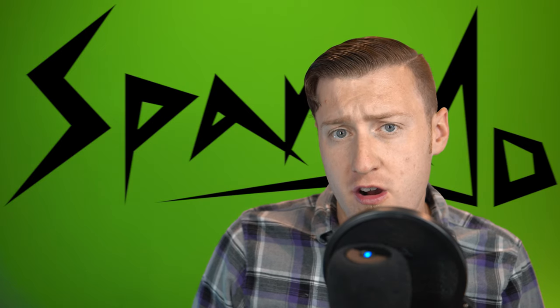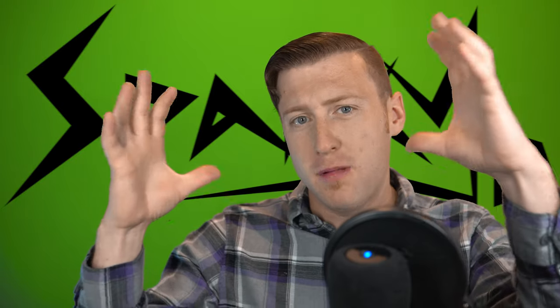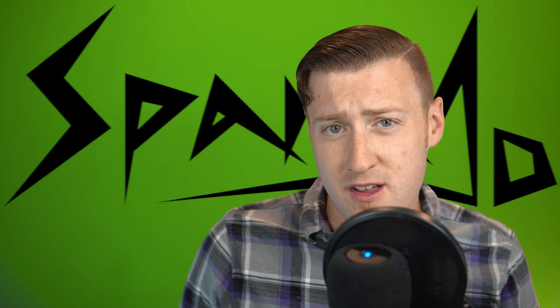One of my few complaints about the Majority RS Pro is that they present the idea that this is a large diaphragm microphone. They dress up the capsule in this big plastic circle to make it look like it's 34 millimeters, but really the diaphragm is only 14 millimeters. It's a common size in cheap microphones, but it's still small.